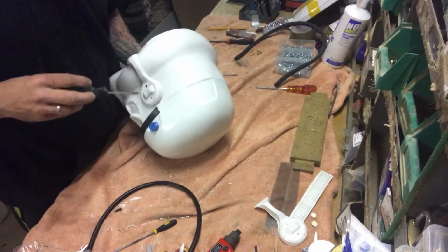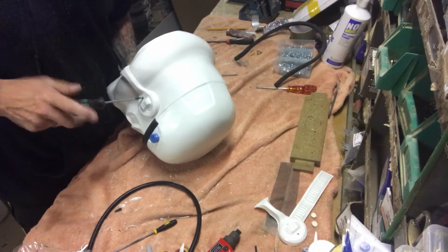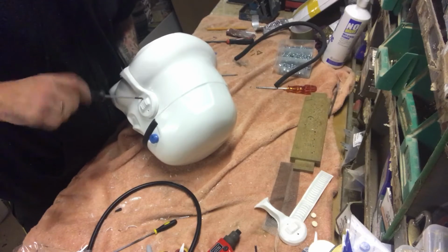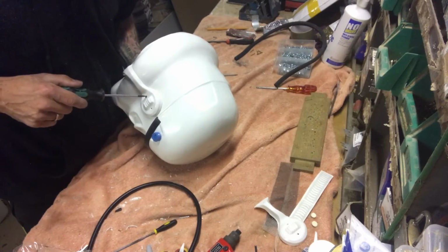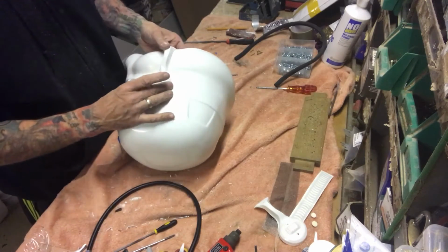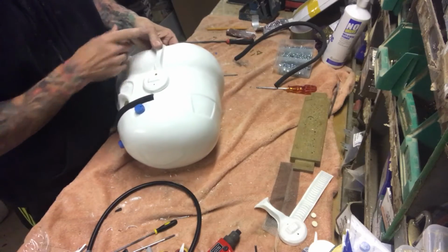Tighten it up so it nips in. Just watch the ear pull in, then a little bit more, but watch it over tighten. If you start seeing that concave a little bit, you're going too far. So when you got that one in, check it's sitting right, because it can still swivel. So check it's sitting nice back that way at the bottom.